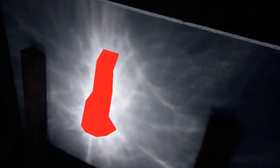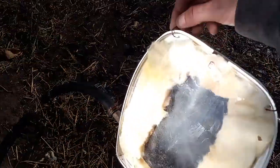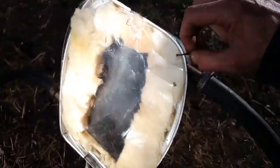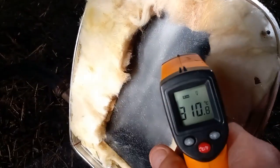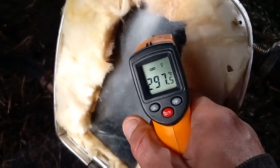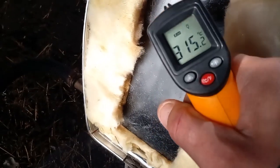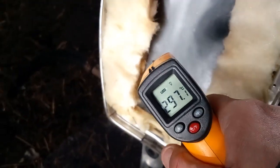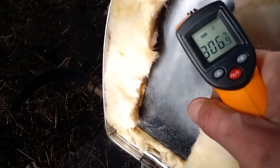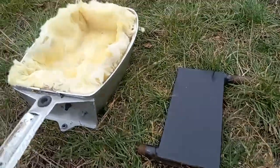The location of that high temperature is this spot of solar radiation, and it is obvious that this spot must be inside such a receiver, where it must heat this black surface. Now we will look at its heating temperature, and here we see that the solar radiation heats the black surface to more than 300 degrees Celsius. But this surface is coated with black paint, and the heating temperature will be several hundred degrees higher if the paint is replaced by a selective coating, as in these well-known solar collectors.